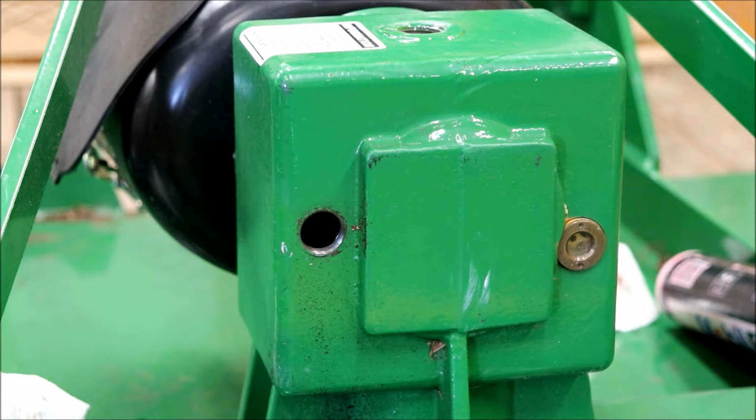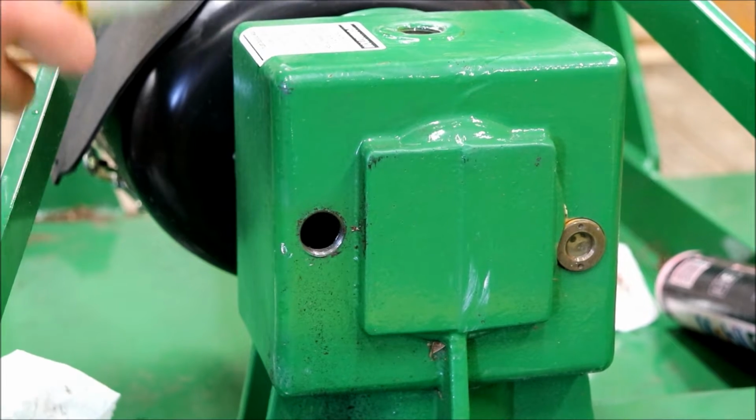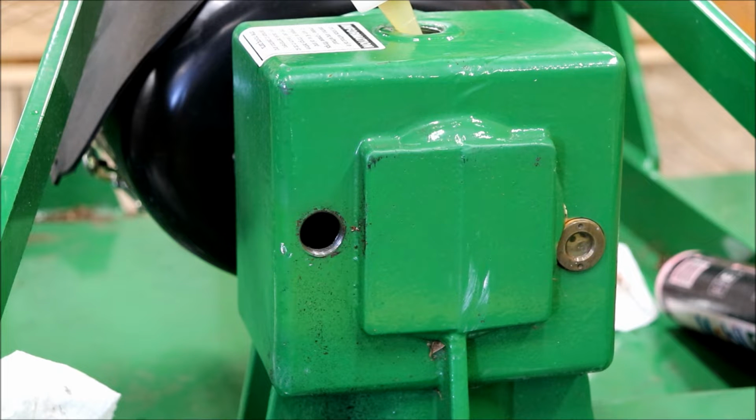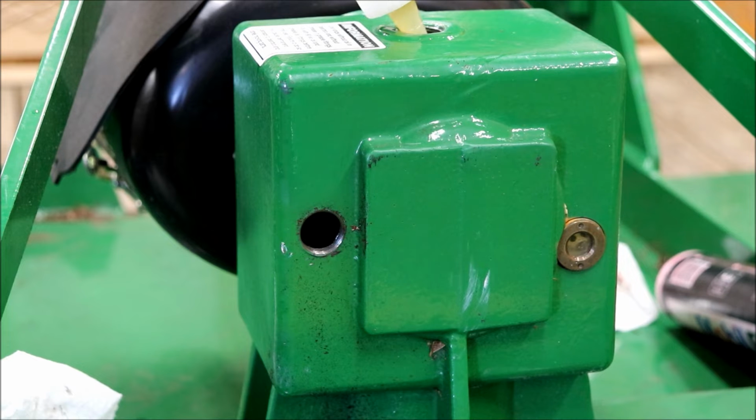Alright, so I got everything sucked out, and there's still a little bit of oil at the very bottom. I just can't get that out. So hopefully I got the camera set up so you can see when it gets to the sight glass here. I'm just using this 80W90 Valvoline, number 1 gear oil brand, it says, probably because of the cost. I think this is the most inexpensive quote-unquote name brand they have in the store. So we might have to do this a couple times and just keep an eye on it. I did this last year when I realized it was full of